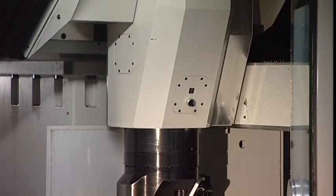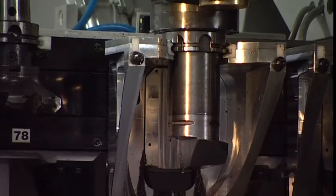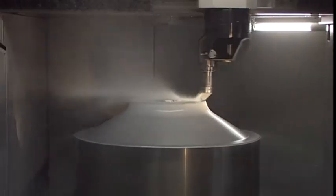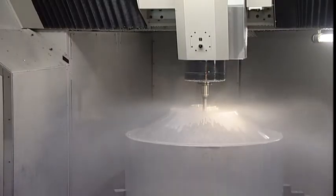A turning tool adapter, which is stored in the same pickup station, is locked directly to the vertical ram. This ensures that none of the cutting forces puts any load on the main bearings, resulting in a longer spindle lifetime. Besides the standard spindle attachments, Unisign is always capable of designing and producing special purpose heads to customers' requirements.